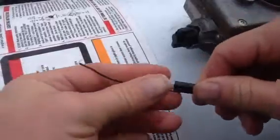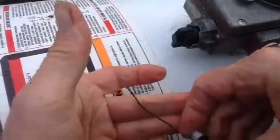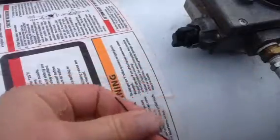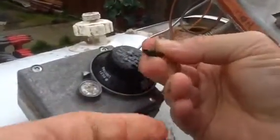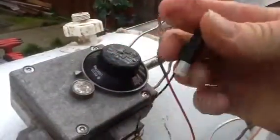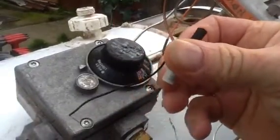There's usually two wires on this, but one of them you'll squeeze it and you'll feel it spark. Anyway, you just hook it into this wire here of the water heater. The red wire, just a little black wire into that one there, and then tie the little button on the side of your gas valve, and you got a $1 piezo lighter for your water heater.